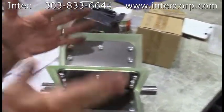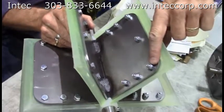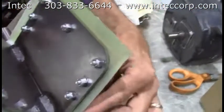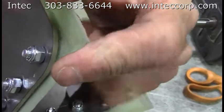Take the old seals out, put the new ones in, and tighten your bolts down to only 40 inch pounds — that's just barely snugged up. These are little nylon lock nut type nuts on here, so they don't have to be squished down really tight. If you tighten too much, it will pull a small gap right there on the seal and it will not seal up quite correctly.